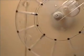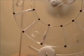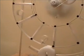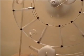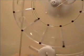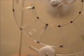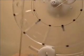Okay. I don't know if you can see that or not, but the bottom magnet is still working fairly well. You need to be going fairly fast to do it, because the energy to do this comes from the rotation. If you come by slowly, you can see that here's one slowly. See, you don't get much of a rise out of it. That's because the energy for pushing that magnet against gravity comes from the rotation of the wheel.